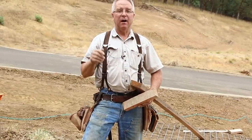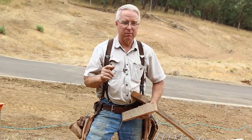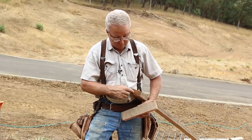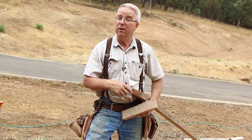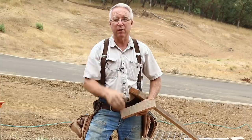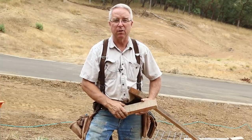If you pick it up, I will bet you, I don't know what I would bet you, but it would not be a small bet, that every twisted board you pick up is going to have the heart in it. Heart center, boxed heart. Try to avoid it if it's a board that needs to remain stable, flat, straight, predictable for a long period of time.